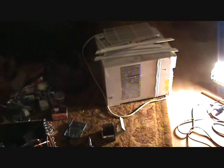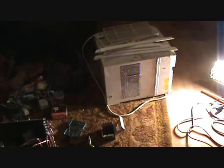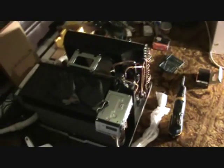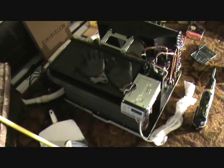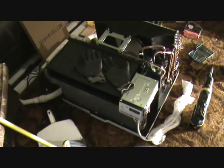This was the air conditioner we pulled out — that's not an insert, that's a one-piece. How on earth can you install a one-piece properly without an insert? That sucker was heavy too, just kind of held up by a couple screws in the trim. I feel sorry for anyone who bought one of those types. Get something like I'm doing with the insert — you put the housing on, get everything square, attach it properly from the inside with screws, then slip your insert in.